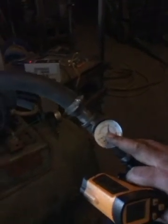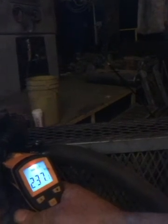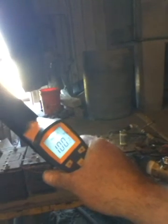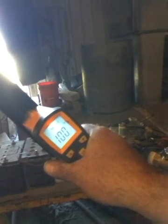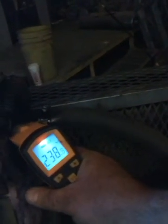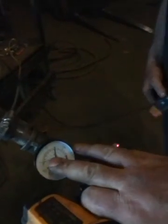Pressure is still passing in at about 70 psi. Outlet temperature is now 235 degrees — we're above steam temperature and rising to 237 degrees. Inlet is 100 degrees, coming directly out of the tank. That's a super-saturated water vapor and air mixture compressing to 238 degrees at 70 psi.